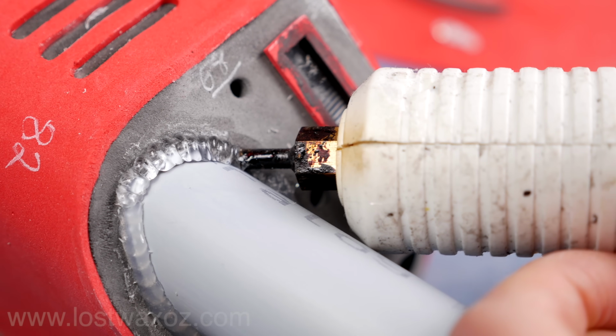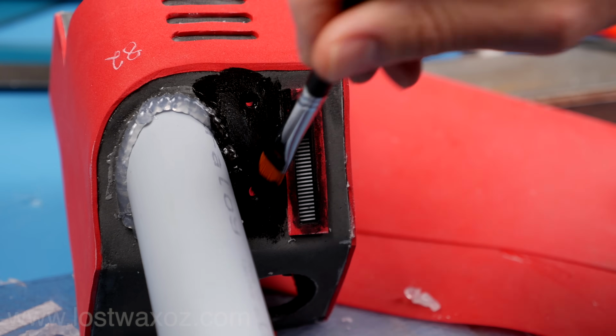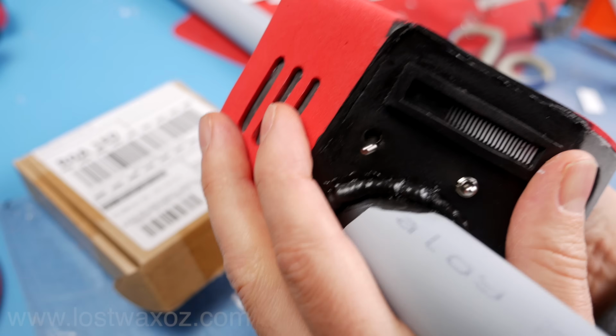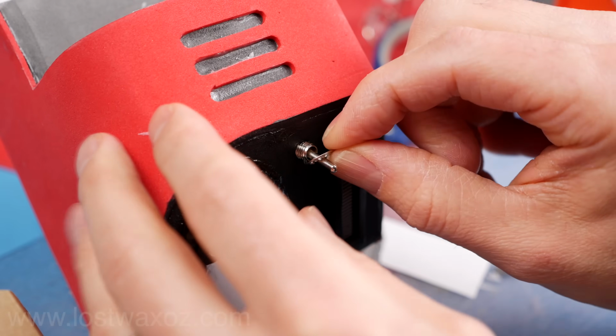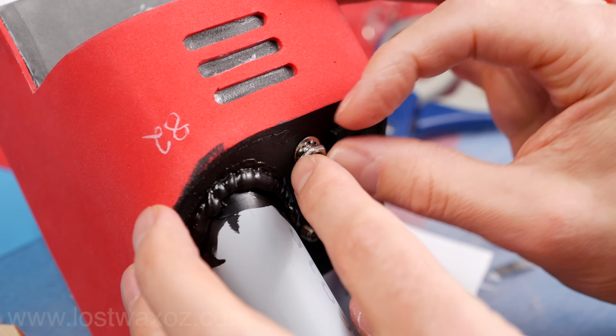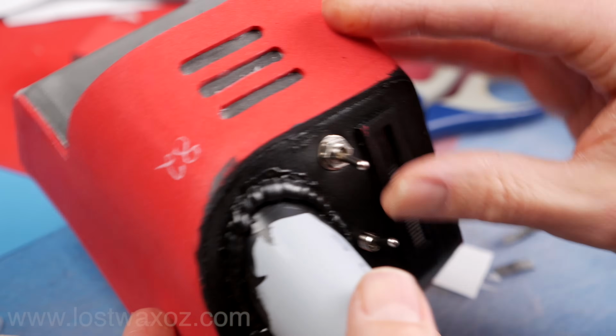Once that's cooled, paint around the holes where the toggle switches come out so you won't get paint on them later. Toggle switch, I'll put a link in the description if you want to find where I bought mine. Once the paint is dry, you can install the toggle switches. Obviously you can't tighten the nuts super tight because the foam will just compress.